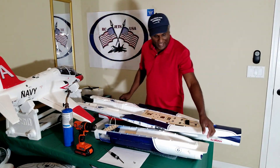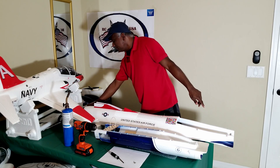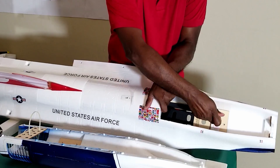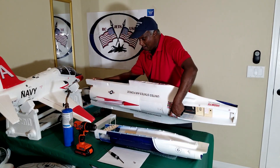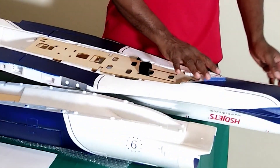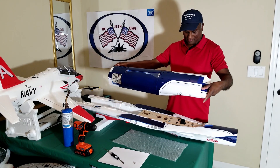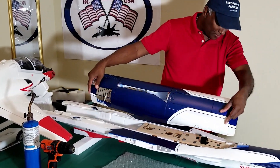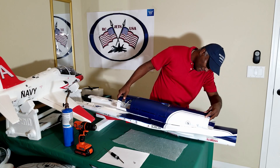So what I did was, just to make sure that I get the correct spot, I turn this upside down and put the pin, insert it from where it comes from the bottom, and the screw goes here. But I insert it from the opposite side. The trick is to put some lipstick here. Once you have the lipstick, just align these button kind of things to make sure it goes exactly to the same spot — these two are the good indicators. Let's put it there.